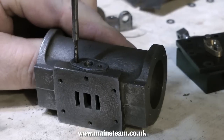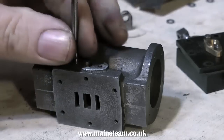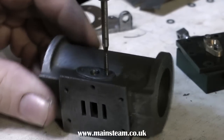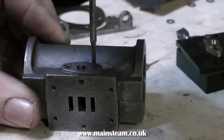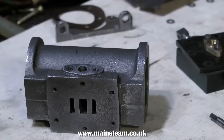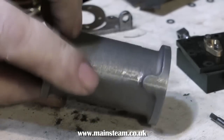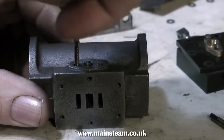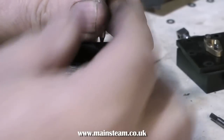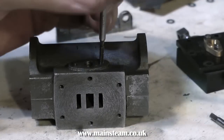As before with the port face and the end of the cylinder, tap the holes using a 7BA tap. These are not very deep holes so you can go straight in with a second tap here, but don't forget to go in with the plug and in between times tip out the swarf that is in the holes. Whilst using a tap, particularly with cast iron, the powdery cast iron gathers in the bottom of the hole, so get rid of this from time to time — you don't want the tap to lock up. You can see how much comes out; it's more than you think.